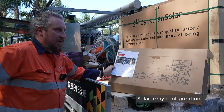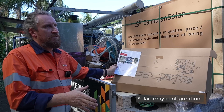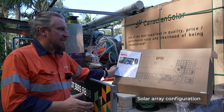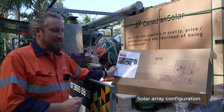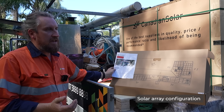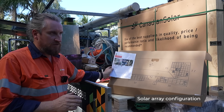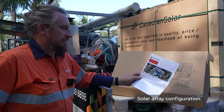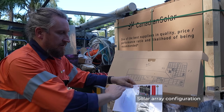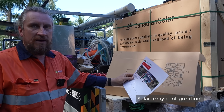Like all our systems, they are designed both off-site and on-site. The original design was done in consultation with the customer, and going home and looking at some aerial maps, we came up with an optimum layout for the panels to fit. But like life, it never stays the same until you get to site — we had some slight changes. With this one, to make it compliant with the overhangs of the panels and the screw lines, we had to adjust how we were going to lay them out. Instead of portrait, we've gone landscape, which just means we've got a lot more rails to do — going up and down the sheets instead of across the roof, to make sure we've got the right amount of feet and the right overhang for panels.